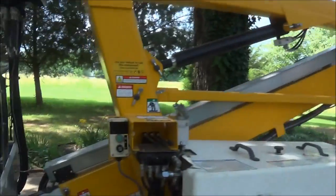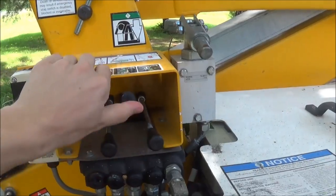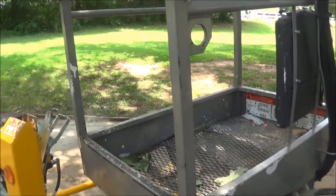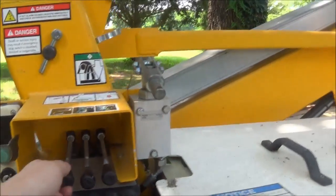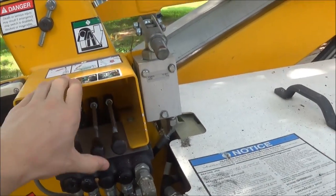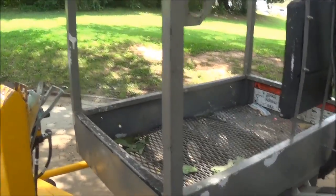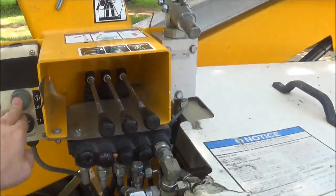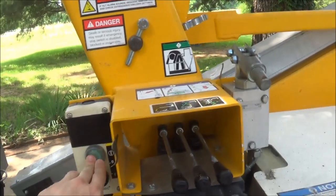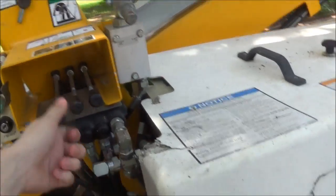Alright, let's get started. You have more hydraulic controls here. These are your ground controls, pretty much, if you're working on the ground. Say you want to put a couple tools in this bucket and bring it up to somebody higher, you can do that here. You have all operations of it except the telescope part, which you can only control inside the trailer. And just like the hydraulics over there where you have to push the safety down first, this one does it too. This is the safety button down here. You push that in with one hand and you control it with this.